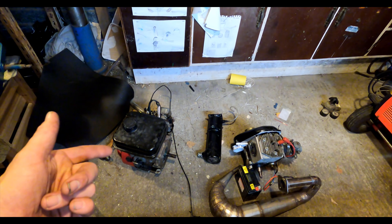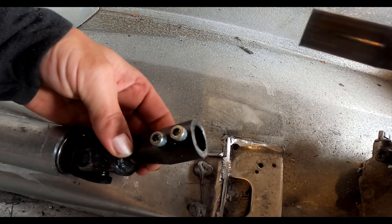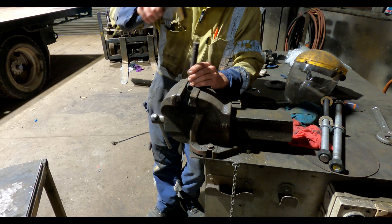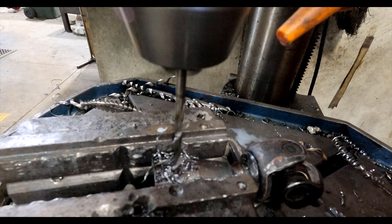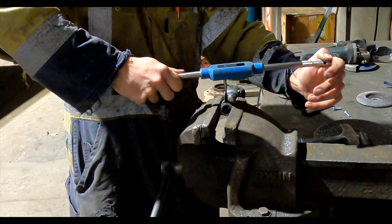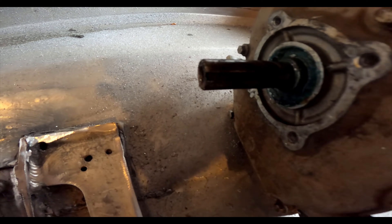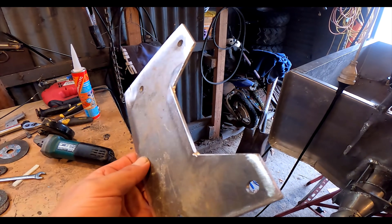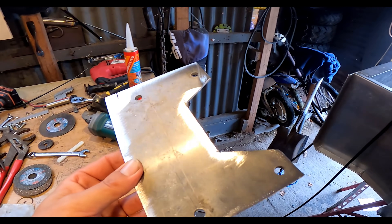You can work these motors and apparently get up to 20 horsepower, which I find a bit far-fetched. I've made this coupling to fit the motor — it's just got allen keys going through into the keyway slot. I've also made this engine mount plate out of four mil thick aluminium to weld to the bottom of the boat so I can bolt the engine to it.